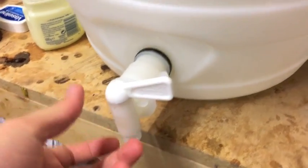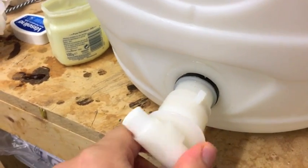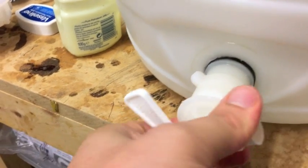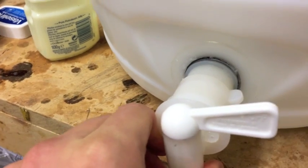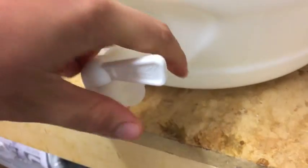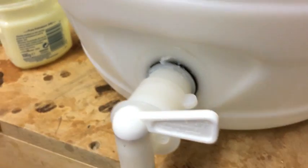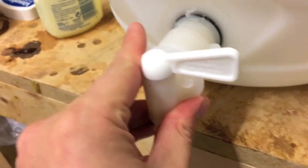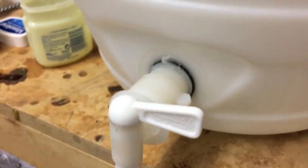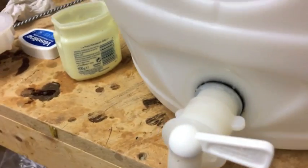Just assembling the tap now. When you're screwing this into place, do not over-tighten it. As soon as you see that washer starting to bite in there, you really don't want to turn it much further than that. There's quite a bit of Vaseline around it, but the washer is already starting to get squeezed out a little bit even though I've just done it finger tight. You could easily over-tighten it thinking it needs to be screwed in tighter and just pop the washer straight out of place. Literally, as soon as you start to feel a little bit of resistance, stop.